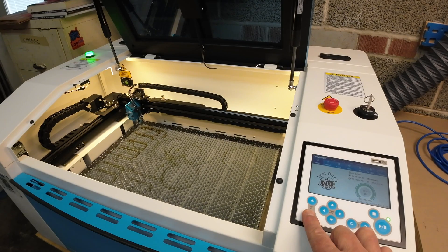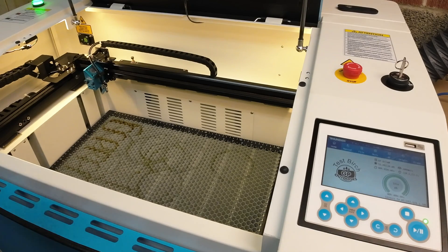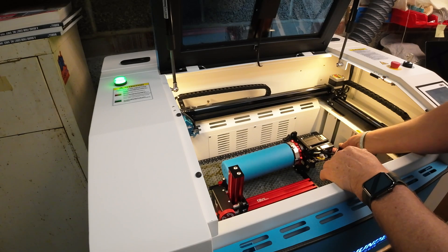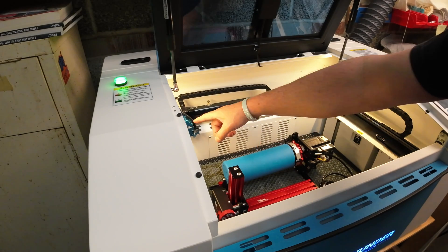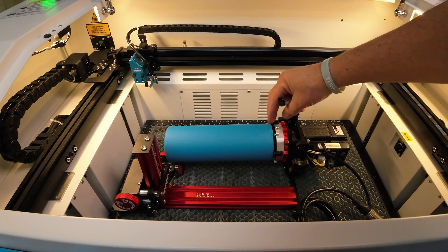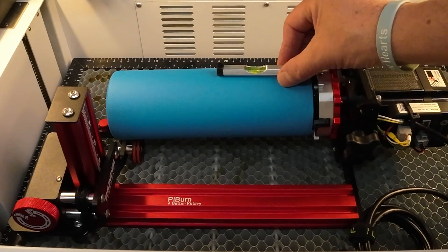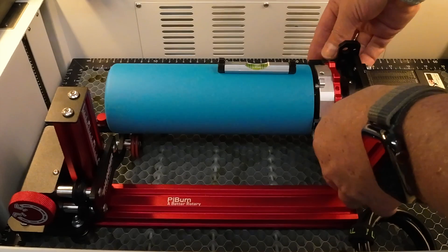I'll level it and get everything set up before I plug it in. I'm going to drop my Z-axis all the way down, then go up one bit. I'm also going to make sure that my laser head is in the far back corner so it's right out of the way. I'm going to place my grip on the honeycomb, making sure I have a lot of room to plug into the rotary. The stepper motor always goes to the right, closest to the rotary plug, and I need to be careful that the head doesn't come in contact with any of the brackets or the mast in the back. I have the tumbler firmly in the grip — I just want to make sure I can level it here. In order to do that, I'm going to loosen my thumb screws.